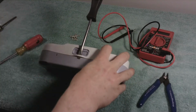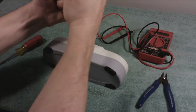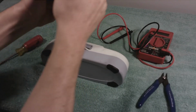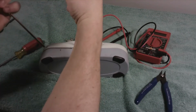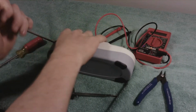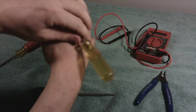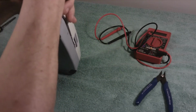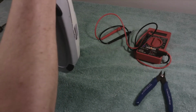Then I also need to account for conversion losses, so I'm going to need to go above that just a little bit. To be in the safe zone, I would like to do 1,250 watts, so 5 times. By doing that, the extra power I would be producing, because in this scenario my rig's only pulling 250 watts and my solar for 6 hours a day would be producing about 1,250 watts, means that extra 1,000 watts would be going to the batteries. It will actually be going to an inverter, and the inverter will charge the batteries. That's what I'm going to do with this. That's my plan, and eventually I'll make a series about that as well.